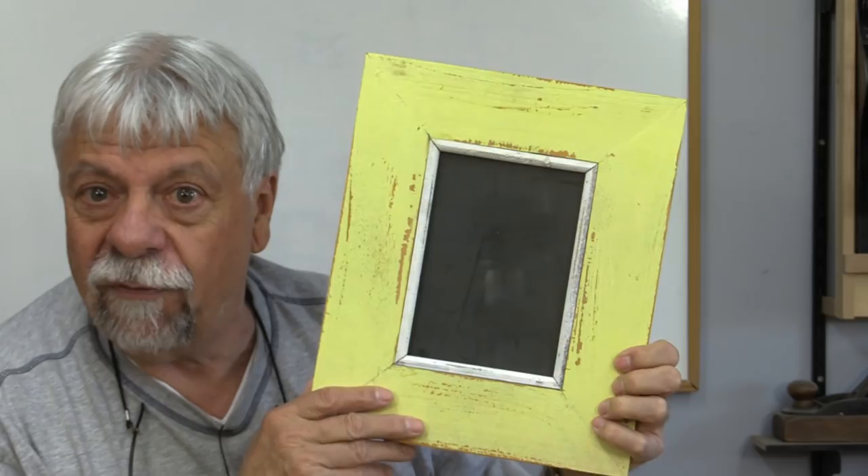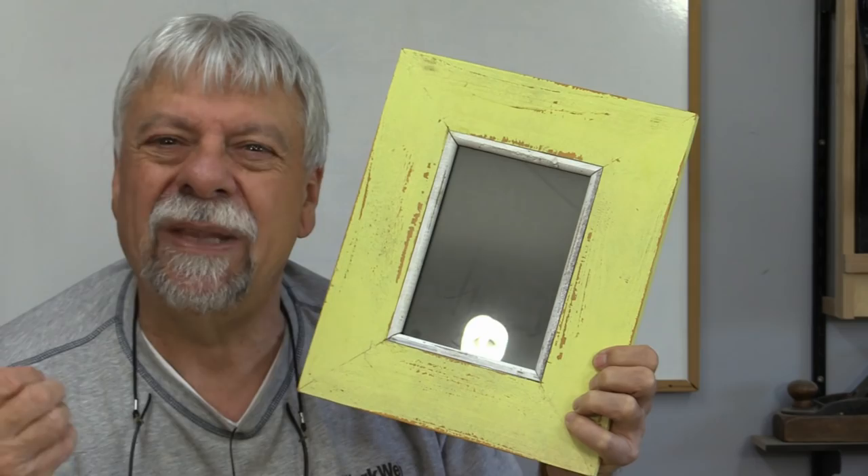In this case they've used paint to distress it, and it's pretty easy with paint — you can make different layers. We're going to do something a little more challenging because we're not going to be painting it; we're just going to use a top coat so that we do a natural wood distress. We basically mark the wood by scratching or scraping, exposing the cross grain. When you expose the cross grain, more of the dye or stain soaks in, making it a little darker — that's what makes furniture look distressed or antique.